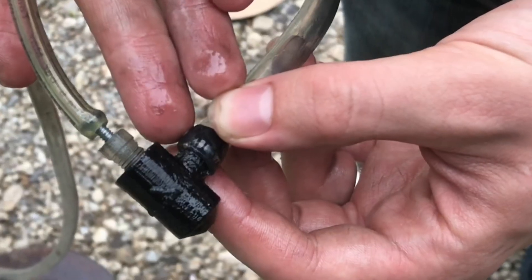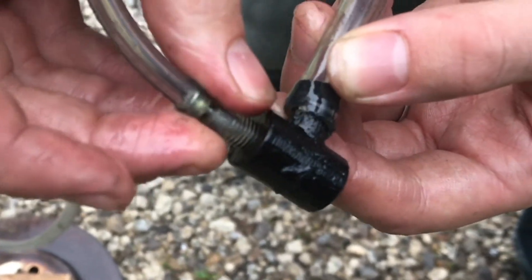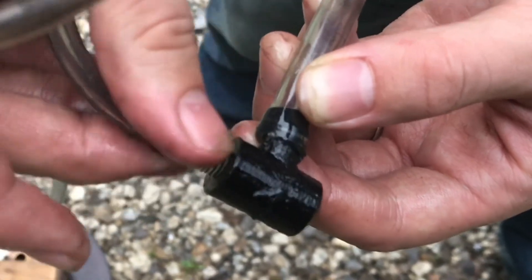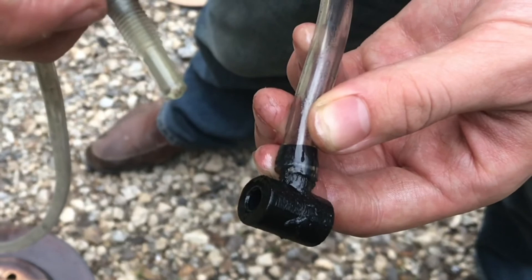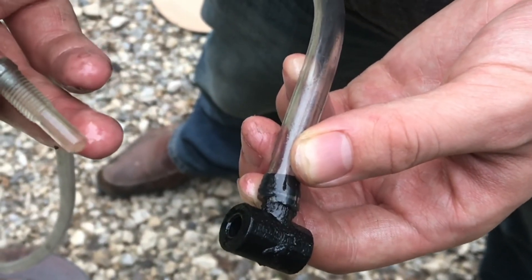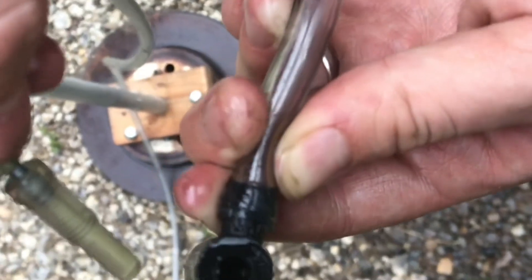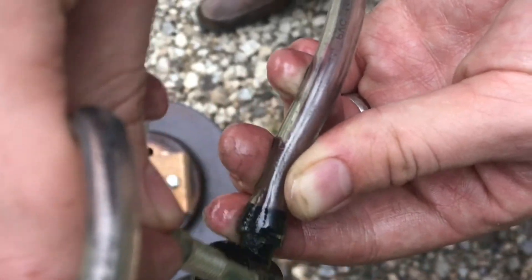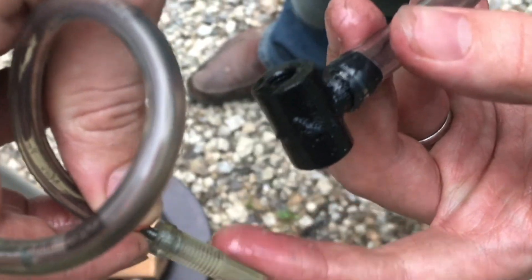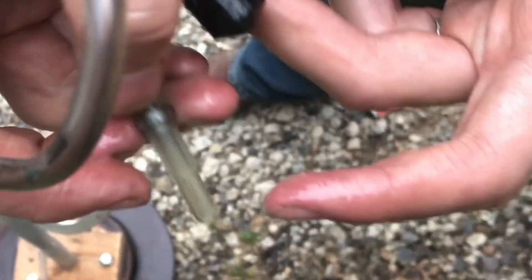Previous versions of the atomizer have just been a single piece. The difference here is — I'm going to pull this part out — this is the fuel inlet. There's a hole that comes all the way down and a 15-thousandths orifice at the tip, so just a little bit of fuel is coming in. Down here is where the air comes in. The air comes in at a little bit of an angle, spirals around, and it would be spiraling around this when it's inside, and then it kind of funnels in.